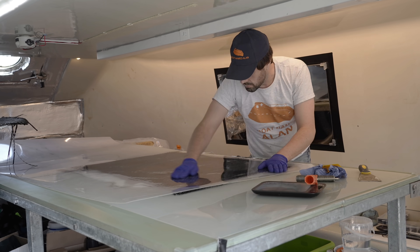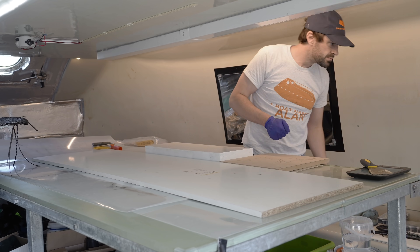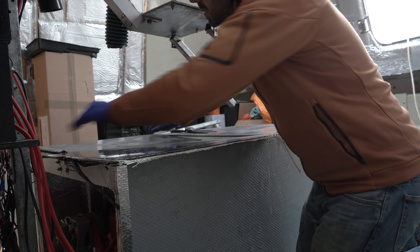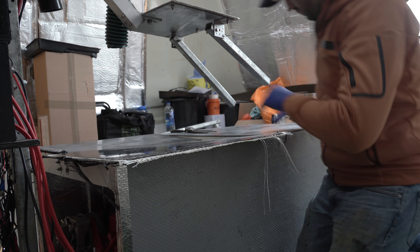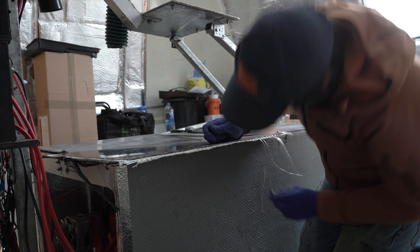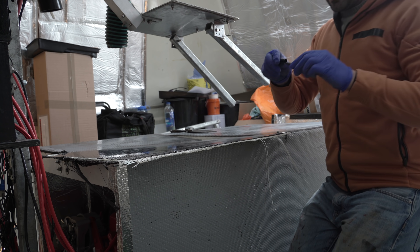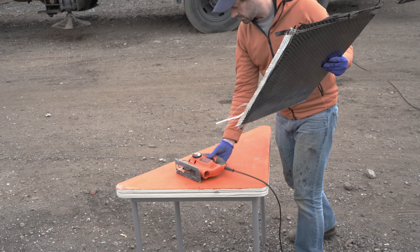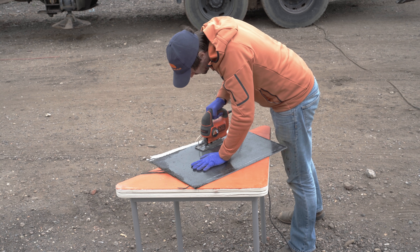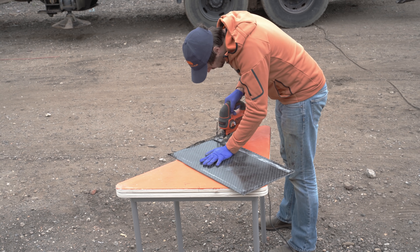I do have a few pneumatic presses that apply pressure between the boat's upper shell and the worktop, but in this instance I'm happy to use the top sheet of polypropylene, some flat boards, and then a load of heavy cans and old lead batteries. Once cured overnight, the composite sections of the lid obviously have messy edges. I use the set square to get a reliable angle for where the sections intersect in the middle, but beyond that I wanted to mark up the cut lines on the cowling itself. I could take measurements but it would be daft to allow any small errors to give me a badly fitting lid, so a sharpie run along the lid surface using the cowling as a guide was spot on. One of you lot shamed me for having a Black and Decker jigsaw, so I purposely dug it out of my tool chest and have engaged it in spectacular fashion here. I find jigsaws can make a bit of a mess of thicker composites, but using a fine-toothed metal bit and plenty of patience it all worked out fine.